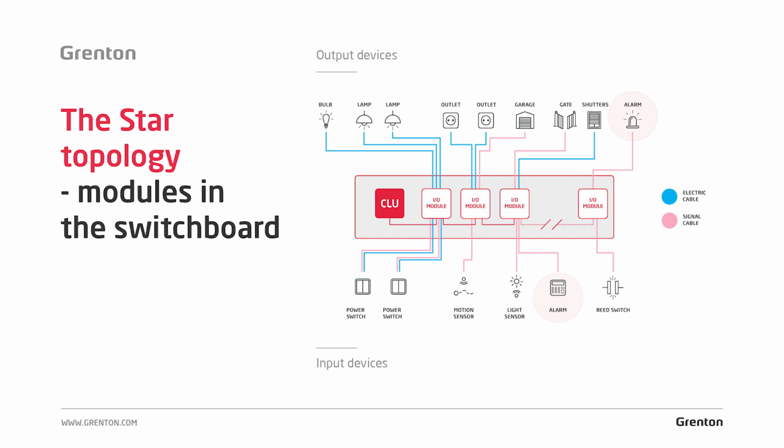For safety, I recommend laying double the number of wires. It may turn out that you will want to add more sensors in the future, or connect more devices, or have feedback from the alarm system. So here, between the switchgear and the place where the alarm system will be installed, where the alarm control panel will be installed, we are talking about the electronics plate and not the keyboard at the door. We lead the UTP computer cable to that place, preferably in double length.